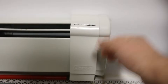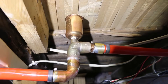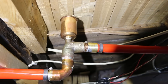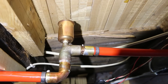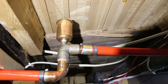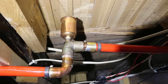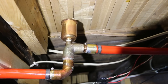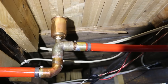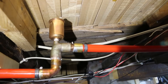Back down in the basement — when I removed parts of the system during renovations, I had to plumb in another automatic bleeder valve. Here's where I plumbed it in. Even though it's not at the highest point of the house, it still works great and I haven't had any issues. Ideally you want to put it at the highest point since air tends to accumulate there, but I now have a bleeder in the bathroom on one loop and this one in the basement on the primary loop.